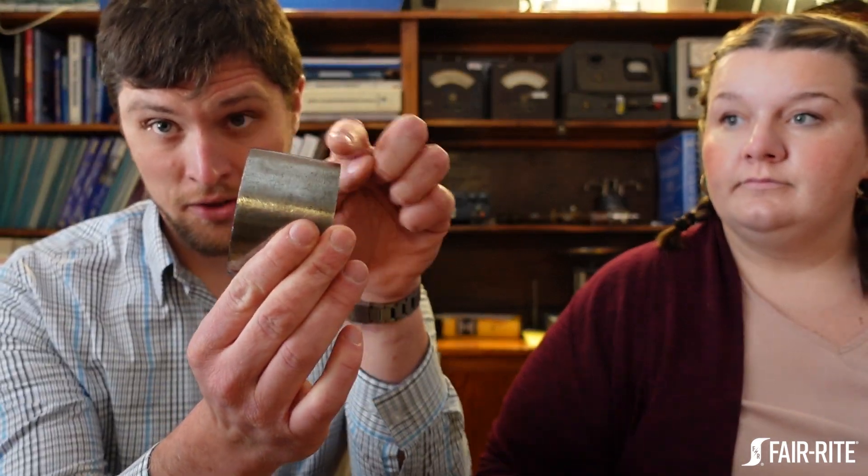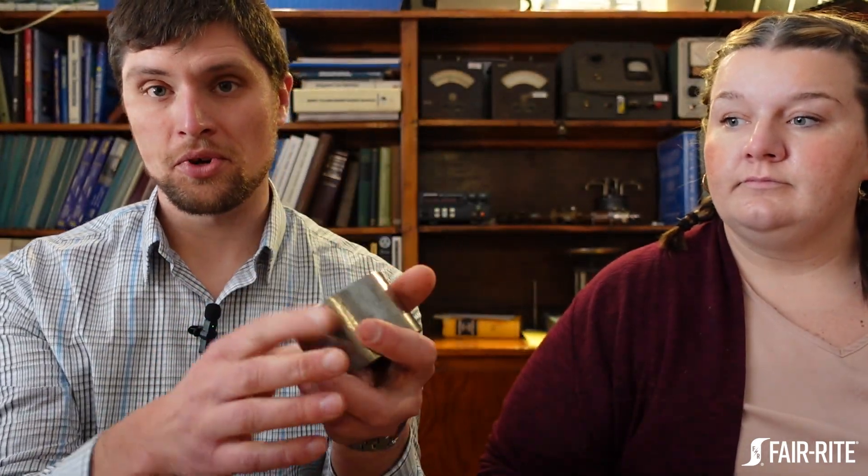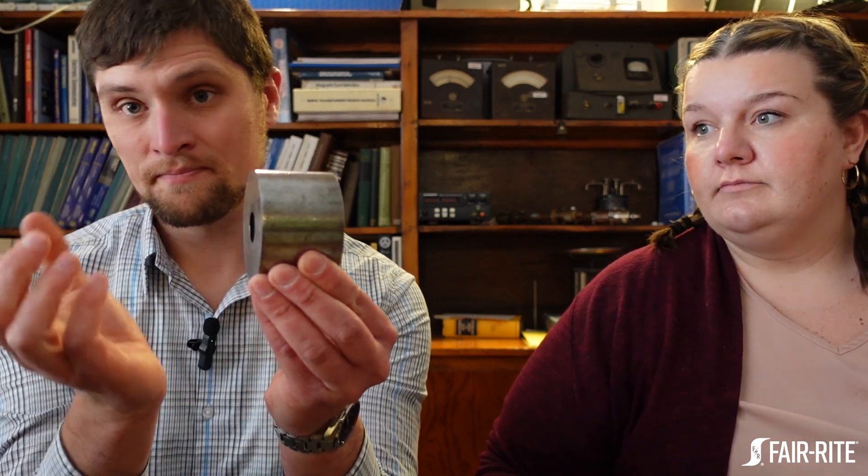From a pressing perspective, your limiting factor is stroke length — the die only has so much length, so you're limited in the height of the part you can make. You could have longer dies to an extent, but the press dictates how long a die you can have. The length of the die isn't the length of the part it can produce; it's going to be about three to four times taller than the part it produces because it has to compact.